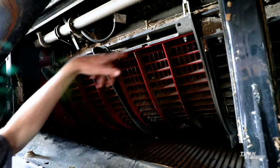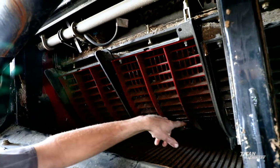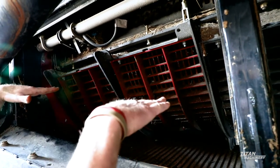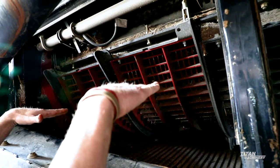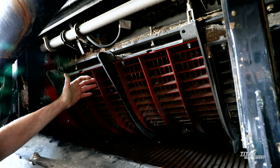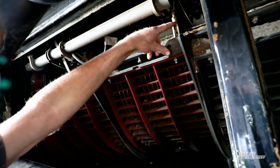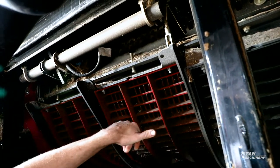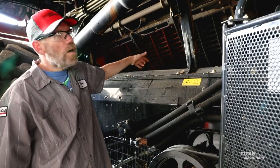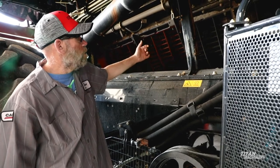Also, check your concaves to make sure they're level front to back. What you'll do is loosen up the stop bolt on the front and the back, then actually bring your concaves all the way up and make sure that you're hitting on the back, the middle, and the front. You want to make sure your concaves are level to your rotor so they're not sitting either down in the front or the back. Bring your concaves all the way up, slowly spin the rotor around by hand, and then adjust this bolt or this clevis up here to actually bring the front of the concaves up or down to get them level to the rotor. If you run them when they're unlevel, you'll run into a lot of threshing issues.